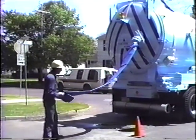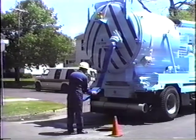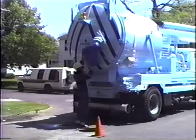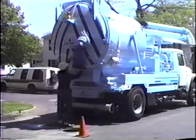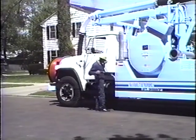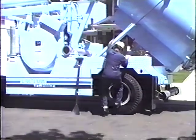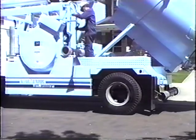After the water drain-off operation is completed, the easy-to-handle nylon drain hose can be refolded and placed back into the storage brackets. A debris box safety prop is provided for those occasions when the operator is working around the unit with the debris box raised. It is extremely important that this safety device be used.